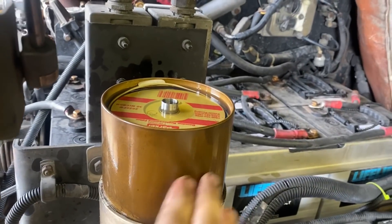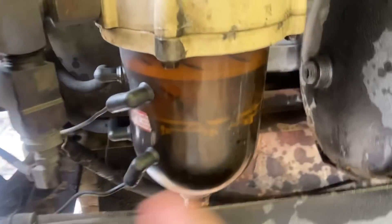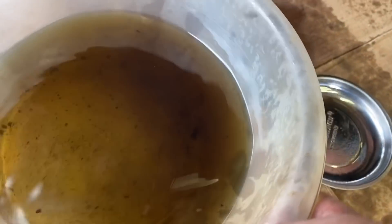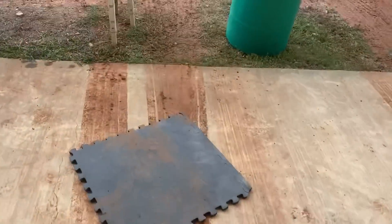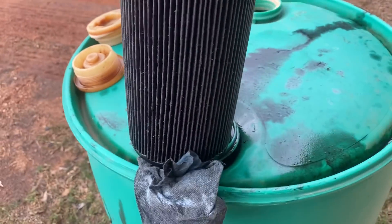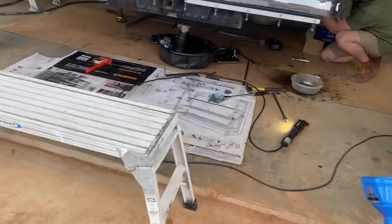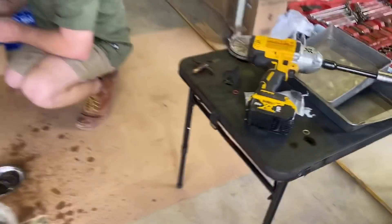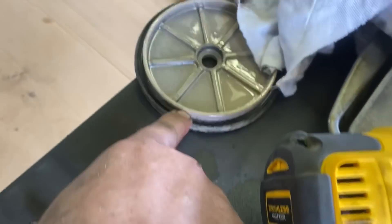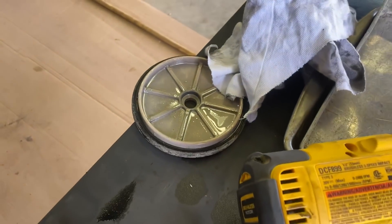We're changing the Raycor filter here, so we put a new filter in. We drained the sump — there's a sump on the bottom. When I first pulled it out, nothing came out; it was plugged up with goo that was down there, so I was able to flush it out. The filter itself is pretty dirty — it didn't used to be black, that's for sure. When you replace it, there's a little O-ring that gets replaced that holds down the lid, and another O-ring that goes around it. Make sure you lubricate those before you put them on.